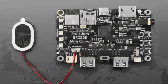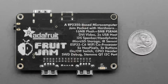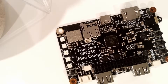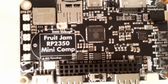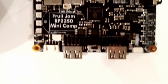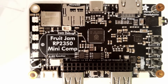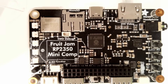It's a credit card-sized computer jam-packed with stuff. The heart of it is the RP2350B chip — the B version, so it's 80-pin — and we use basically every GPIO. There's DVI output using HSTX, so with some smarts you can do 720p, but it's best to do 640 by 480 video. We've got Arduino and CircuitPython support, USB-C for connecting and uploading data, and it can act like a USB keyboard or other device.